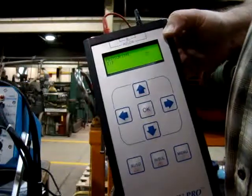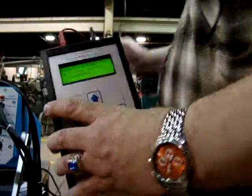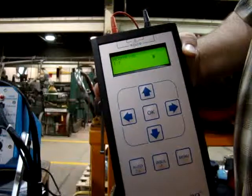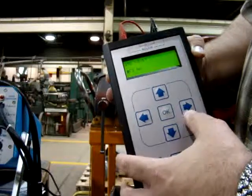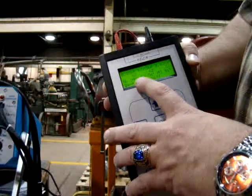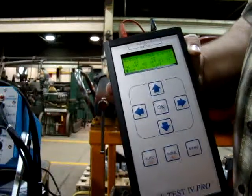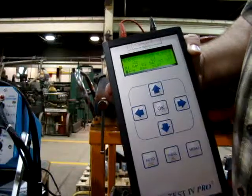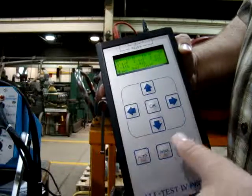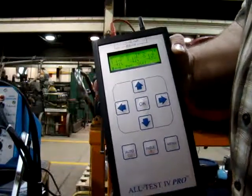Note that there's been a slight change — resistance is balanced. I've got 6, 6, and 5 ohms of impedance. My phase angle has changed position. This means that my phase angle unbalance is due to rotor bars — I have casting voids or a bad rotor. Everything else is balanced, but it changes as well, which again indicates the rotor. When you change the shaft position and keep everything else the same and it changes by phase, then the problem is in the rotor.